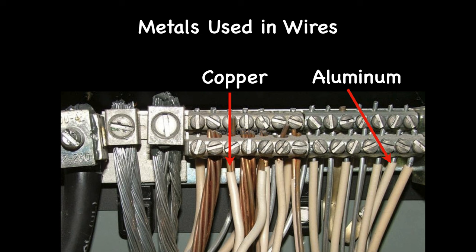Aluminum, or copper-coated aluminum wiring is perfectly safe if connected to receptacles, switches, and other devices rated for use with aluminum, but it can pose problems when it's installed with devices intended for use with copper wiring only, or not installed properly. Because of these issues, aluminum or copper-clad aluminum is no longer used in residential applications. If you have aluminum wiring, repairs are best made by a professional.